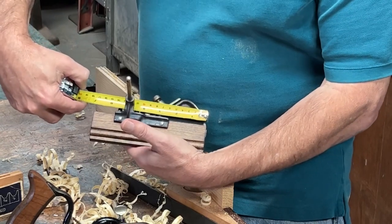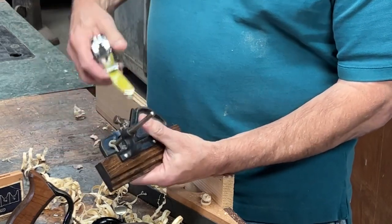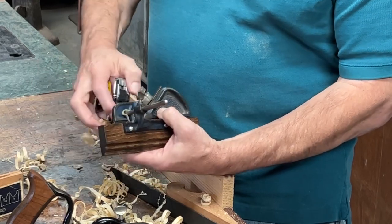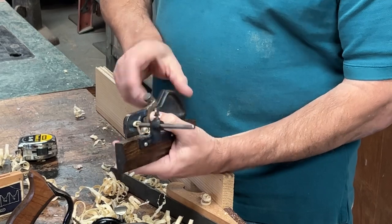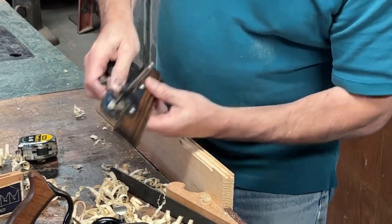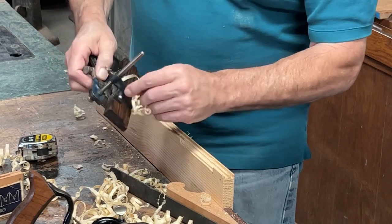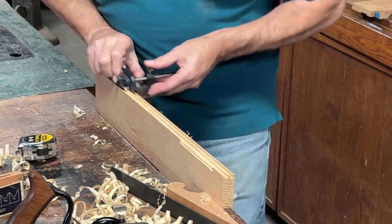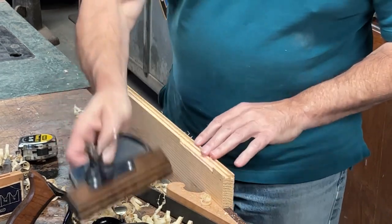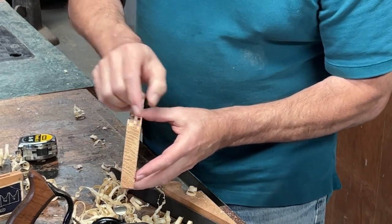This plane is only five and a half inches long without the fence — the fence adds about an inch. It's a nice small pocket-type thing. You could pull this out and stick it in your apron when you want to use it. I'm doing just a 3/16 inch cutter here, and if you keep your finger up in that little spot, the shaving misses the finger pretty well. That's not too bad, not uncomfortable. My preference is to put my thumb outside of the fence and run it. You can see I'm getting nice shavings — two grooves right next to each other. This one has been done with the Record and this one with the 50.